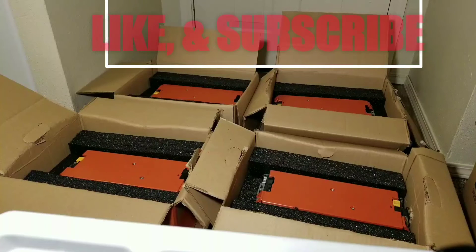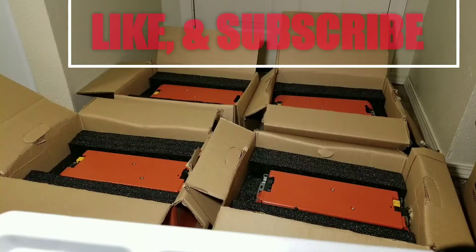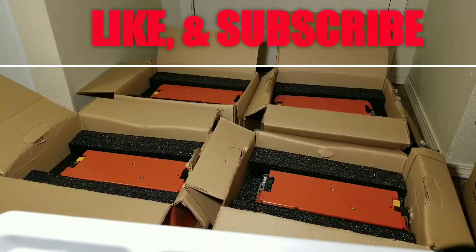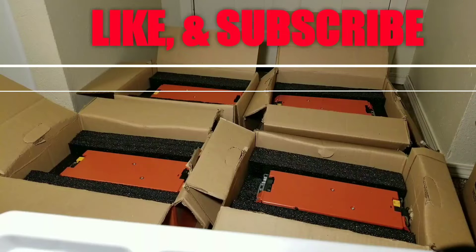If you charge these batteries to the top, this battery can give you 16.4 volts. The nominal voltage is 14.4 volts, and the minimum voltage is 12 volts — at that point your battery is already discharged, around 50% capacity. The maximum voltage is 16.4 volts. Each pack can handle up to about 600 amps peak, and 350 amps continuous. These batteries are manufactured by Sanyo.